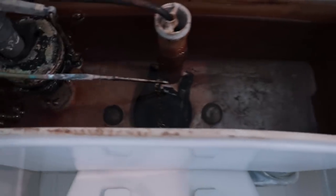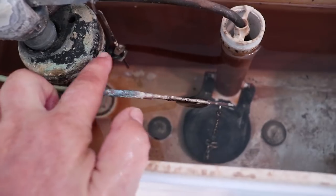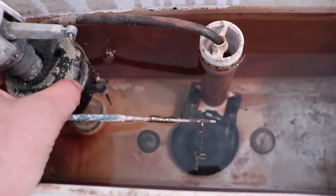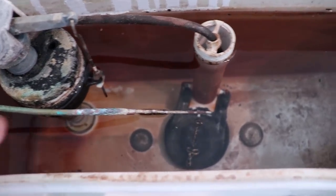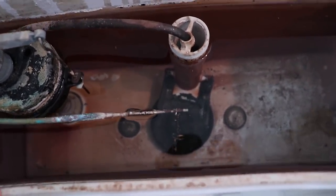It's actually not that bad, it's just a lot of elbow grease. So let's get started. First we're going to investigate - this is the tank part of my toilet. You can see it's refilling itself. The problem is this gasket here - it's all busted. Because it's plastic it lifts itself up and water comes out into the toilet bowl, and once the level goes down the floater asks for more water - and it just goes on again and again.